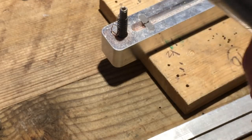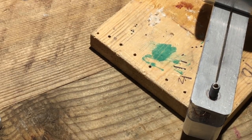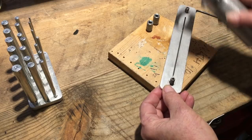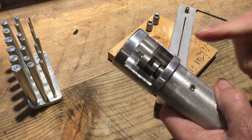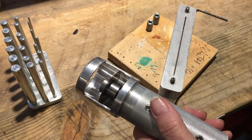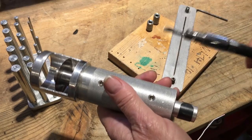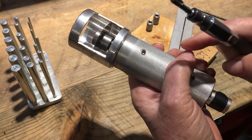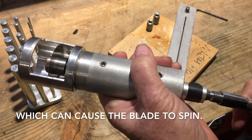Once you get it in so that it fits, you can double-check by putting it back on the holder — it should glide smoothly in the track. Then we need to hook this back up to our flex shaft. While doing this you need to be extremely careful, because now your cutter is live. To re-attach the cable, you need to step on the gas pedal a little bit. Keep this hand far away from that cutting surface, because this needs to spin a little bit so that it can find the matching slot on the interior.